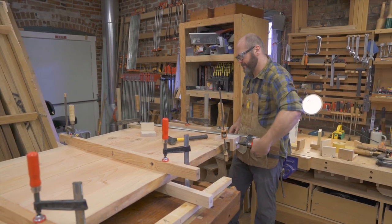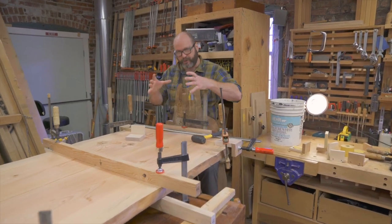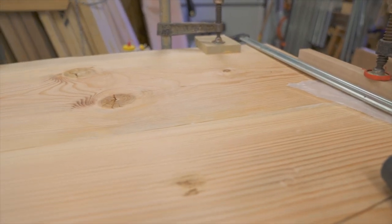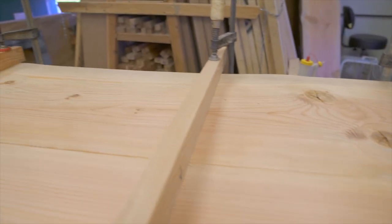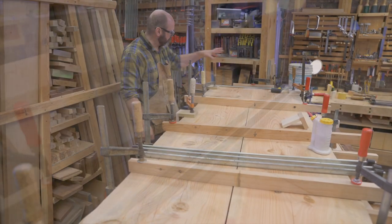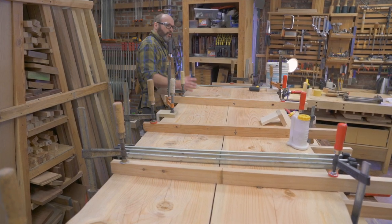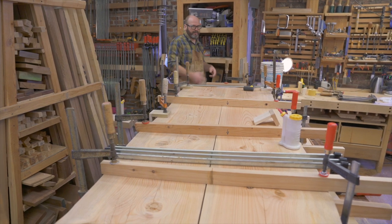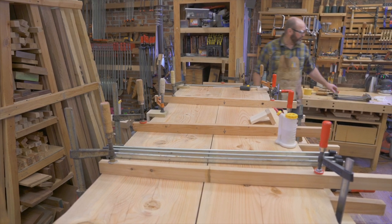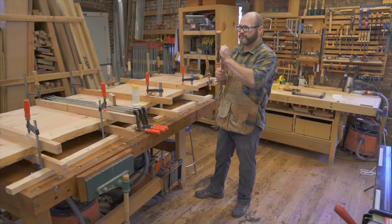Okay, so I come here. Take a look at that glue line right here — you can see it's still open going down. Once I get this closed up and secure and it's looking really good, I just go in one direction. If things are really wonky, there's times when I have to change that around, but the only way you'll know when you've got to do something like that is to do this a lot — you've got to do this kind of glue-up a hundred times before it starts to occur to you how to respond to problem glue-ups.